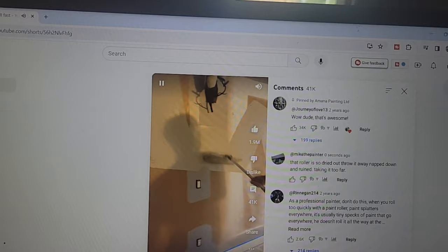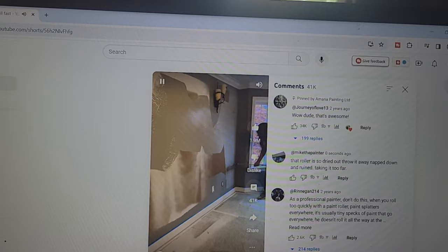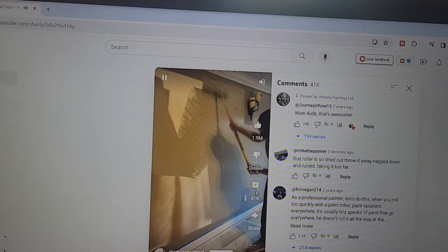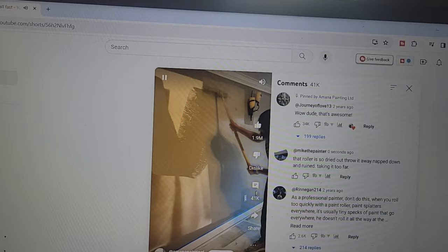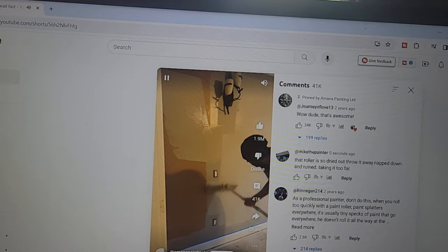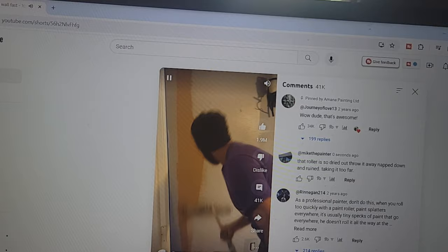Let's back up - here's the beginning. He takes a wet roller and W's out the wall, which is normally what you do when you do a section, but you don't do the whole wall like that even with an 18-inch roller. You can see how wide those cuts are - you spend that much time cutting in and you've wasted half your day when you could make a little two-inch cut, use a nine-inch roller, and go around everything.